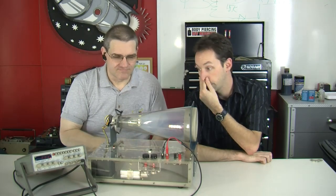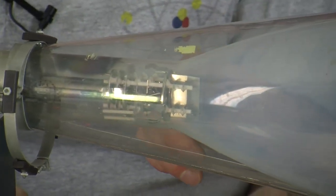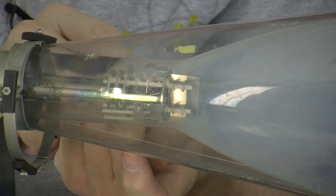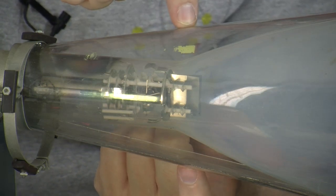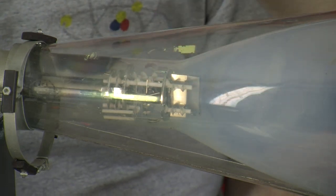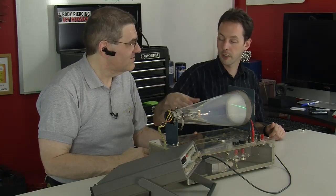Let's get a really big close-up on there. Here is the electron gun and anode and plates assembly – cathode and anode grids right there. One set of deflector plates and another set – you can see the vertical deflector plate easily because it has a horn shape on the front, diverging toward the end. This shoots an electron beam from the back, and by modifying the voltage on the plates it changes the electrostatic charge, deflecting the beam.